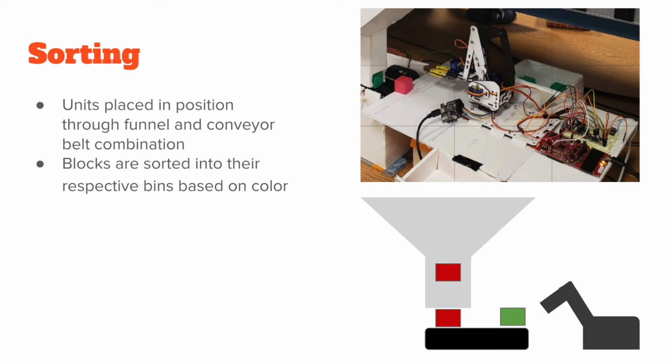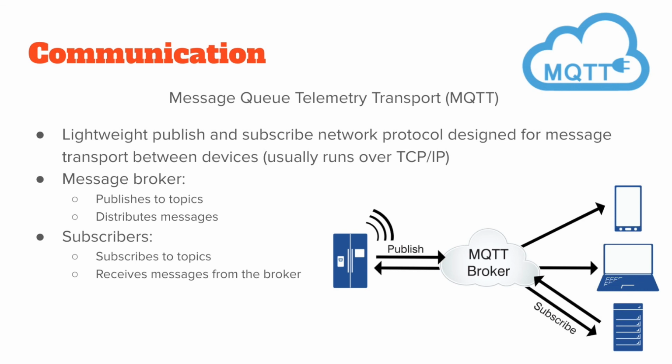From here, a small conveyor belt system fed the blocks to an area within the robotic arm's reach. The statically placed PixieCam right by the arm detected the block color and distance away. The arm used this data to then determine which bin the block belonged in. For communication between the boards, we used MQTT, which is a lightweight publish and subscribe network protocol designed for message transport between devices.